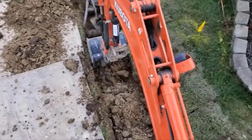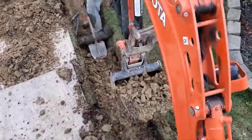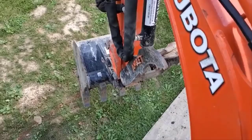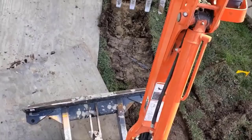Every soil type has some sort of perk. I know we talk about clay, how you can dig a hole the size of a 5 gallon pail, fill it full of water, and it just sits there for days. But we know that if that water sits there long enough, the clay starts to become soft. The ground's no longer hard like concrete. So to my point, everything does leach water. It just takes certain soils longer.